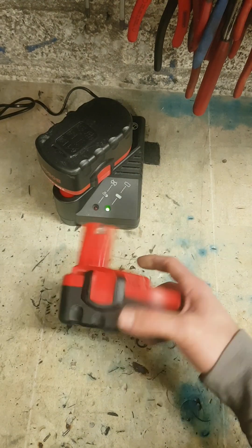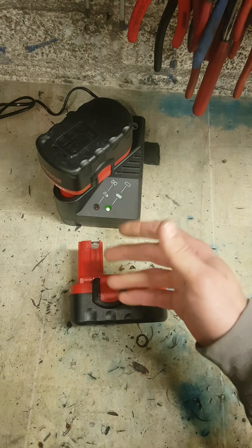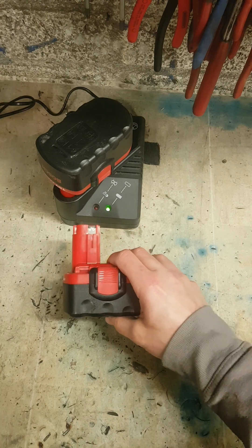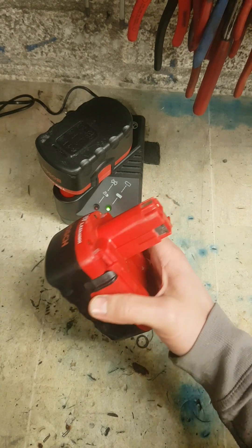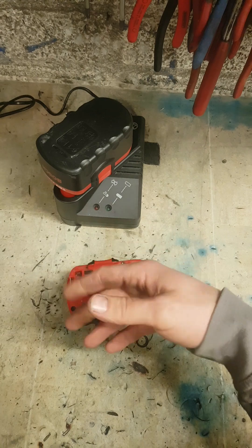If you have these old batteries, it wouldn't be worth buying new versions of these now. Because if you are not using these ones and they have built up memory and are now faulty, if you replace them with new ones you are just going to do the same thing — a year's time they are going to be destroyed again. You need to be taking these out every week and using them and charging them up, otherwise they just die.